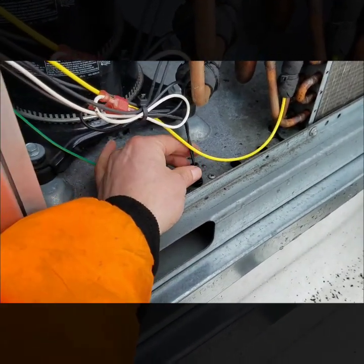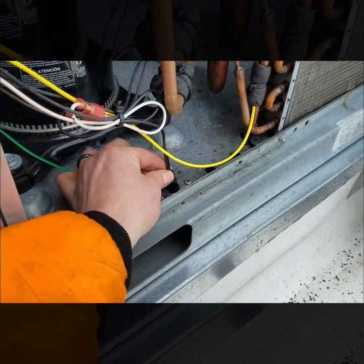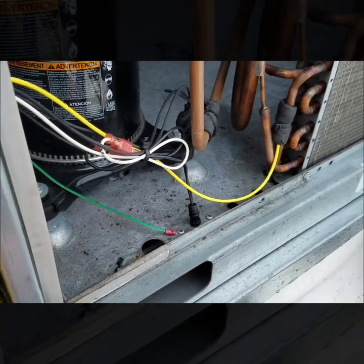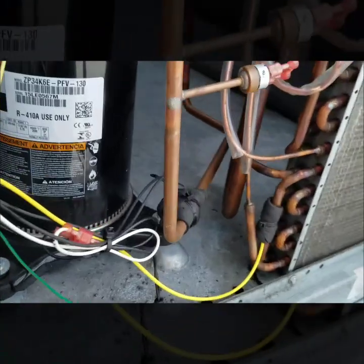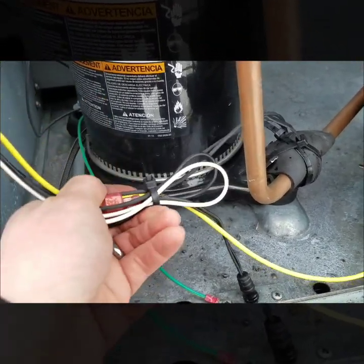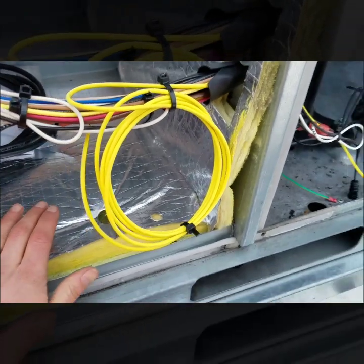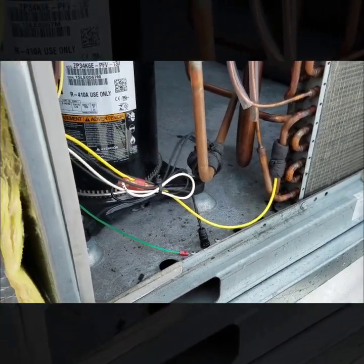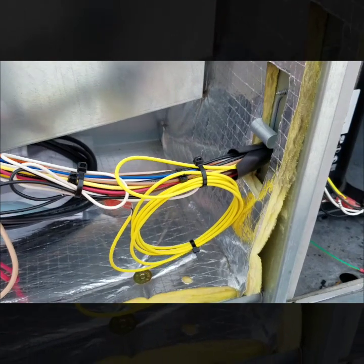Here I just wanted to show the ambient temperature sensor install. There's a little metal bracket — you take two screws out, it comes out, and the sensor slides off by pinching a couple barbs. You reuse this metal bracket. Just make sure when you're hooking this back up you get the ground wire — this goes to my crankcase heater on the compressor. The leads on this ambient sensor are only about six inches so I left it where it was. The new condensing coil sensors have huge leads now, so I actually brought the connection back into the blower compartment to keep it out of the outdoor environment where it can get wet.